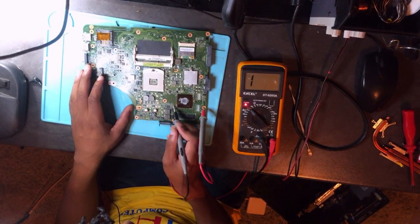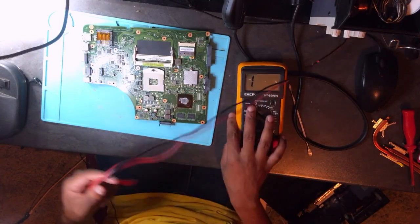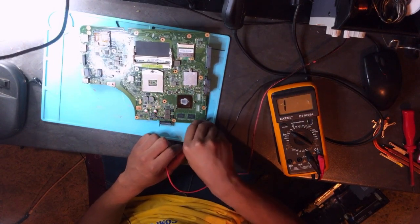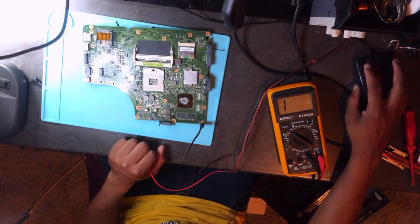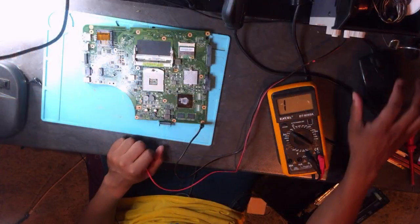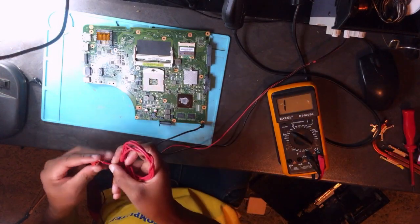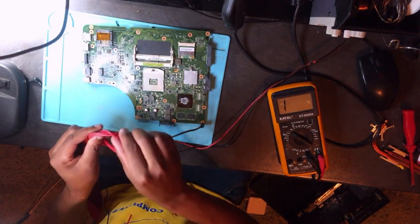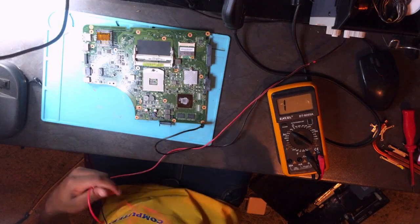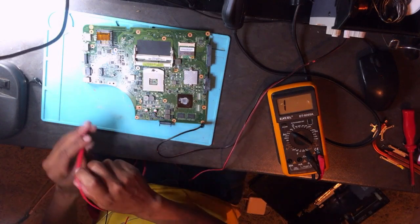And I showed you everything. How do we locate a short? We use the power supply again. How? Connect ground on the screw holes here, you know where, right? Then let me just use this. I want to inject the 19 volts where there's a short. Let's inject 19 volts because this is a 19 volt power rail.